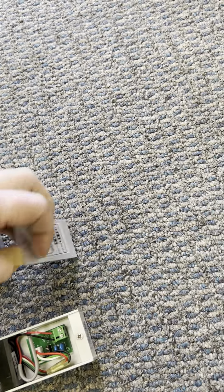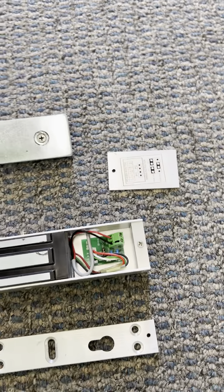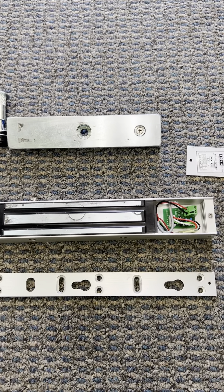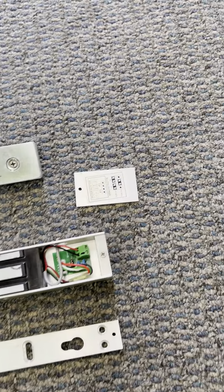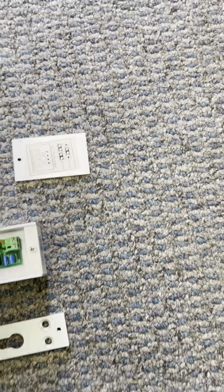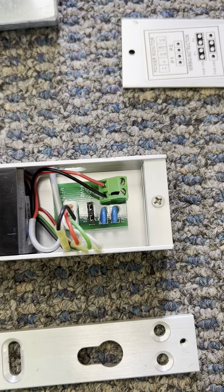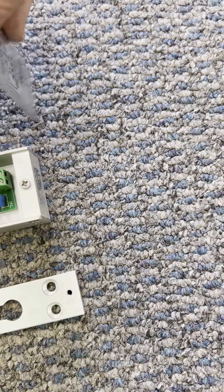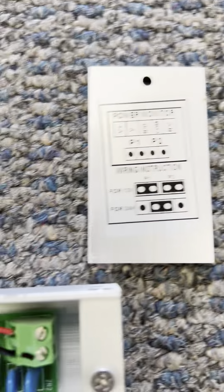These mag locks will come in two different voltages — they can work on 12 volts or they can work on 24 volts. So you need to know what your voltage of your door access system is. We're working on a 12 volt, which is normally the voltage. When you look at the control board on the magnetic unit, there are usually jumpers or there might be switches. This one has jumpers. Right on the back of the cover of the unit is usually the key showing what is 12 volts and what is 24.